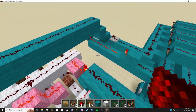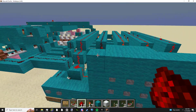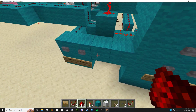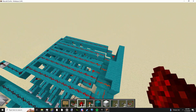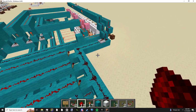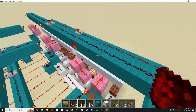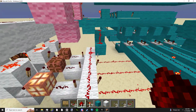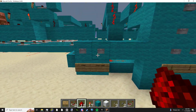But what's nice about it, and it took a while to set up, is we put in 1, right? And now we want to reset that to 4. We might have to clear it first. No, we can just put in 4 and it's going to get it. Because every single time any button's pressed, a pulse is put through the whole memory registers. And if the pulse and the line are on, it will reset it before it writes the new number, which I think is a pretty cheeky function of this mechanic.